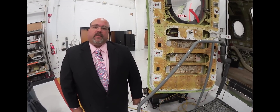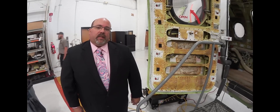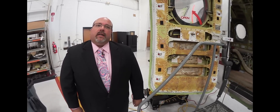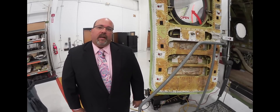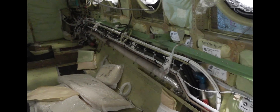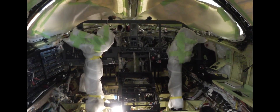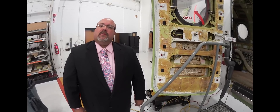Phase three is what we call the wake-up phase. It's the phase in which the airplane comes alive as a fully digital aircraft after being hydromechanical when it comes in. All the wiring is now installed in the airplane, the components have been hung as far as the engine goes, the life-limited components have been reinstalled, and the wiring is installed to about 90 percent completion. This is the phase in which we're installing the all-glass cockpit, powering it up for the first time, and then it goes into phase four which is the basic and advanced checkout phase.